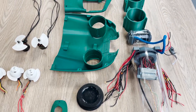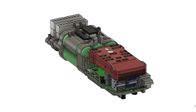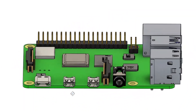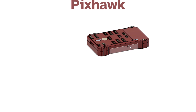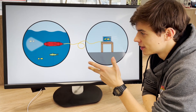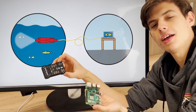Now I have everything needed to assemble the drone except the controlling electronics. We designed very compact electronics. For the main computer on the drone we chose a Raspberry Pi — it runs its own system, handles communication with the surface computer, and manages the camera stream. For controlling the drone itself we use a Pixhawk flight controller, which handles all control loops, self-leveling, lights, and everything else. All three main components — the surface computer, the Raspberry Pi, and the Pixhawk — run open source software so anyone can modify and adapt it.